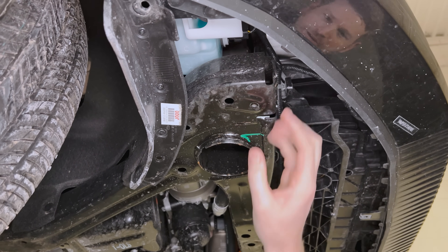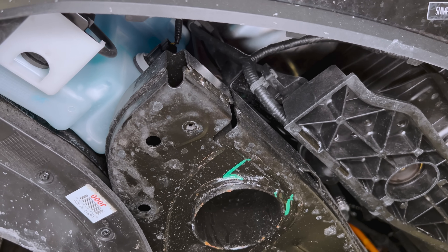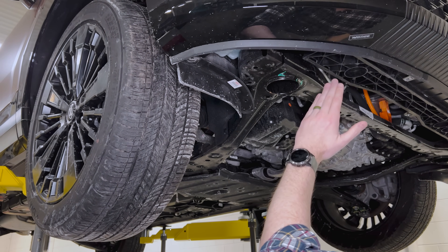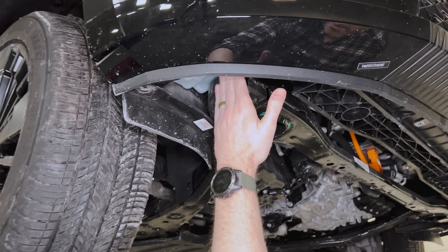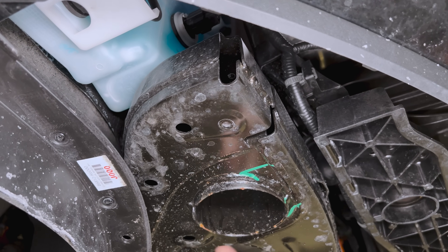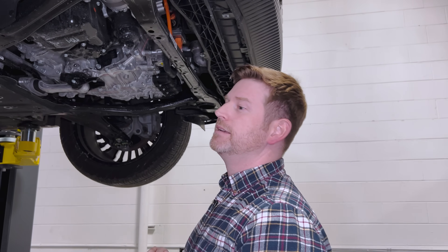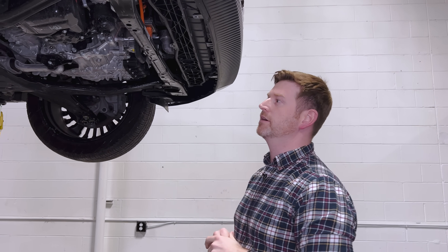You have this little outrigger here. It'd be interesting to see if this is tailored to this vehicle because of width, since SORB is based off of 25% of the overall width of the outer wheel flange — not the mirrors. You do have this large integrated structure here. As they may be changing track width on vehicles, they may be doing a modular approach, or this is being added specifically for this market and carried globally. We often see bolt-on SORB countermeasures on new Toyotas when they come to North America.